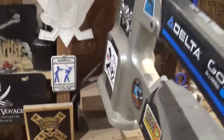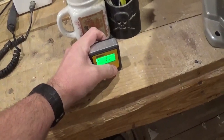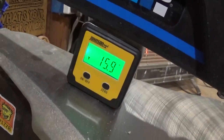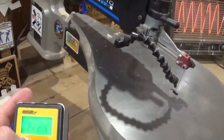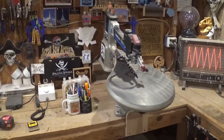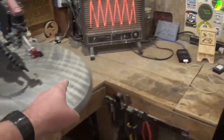The back of the scroll saw is at six and a quarter inches. Now we're going to turn on the digital angle gauge, zero it out, and place it on the scroll saw table dead center. It reads 15.9 — right at a 16-degree angle. I scroll out here for hours on end in comfort, and everyone who has come out and taken a lesson from me has also said they love the angle. They usually immediately go back and put their scroll saw on an angle themselves — that speaks for itself.